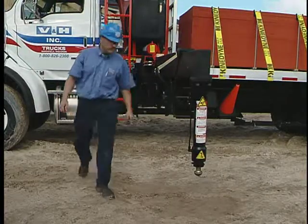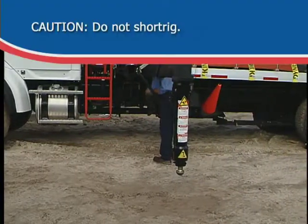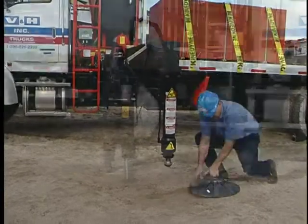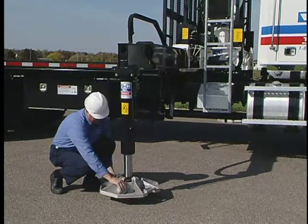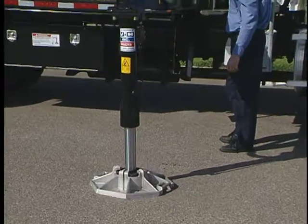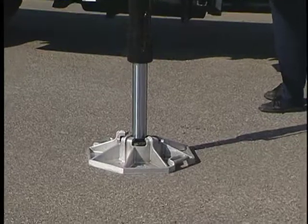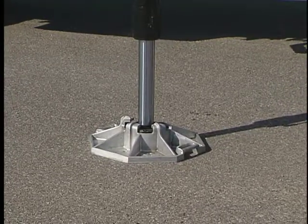With the PTO engaged and hydraulic systems ready, extend out and lower the driver's side outrigger first. Be sure to attach the outrigger pad. If equipped with a slide-on design, be sure the open side faces the crane to ensure crane stability. Place the pad shoe claws out so that settling action keeps the shoe tight. Set the footing down and make sure it's on solid ground.